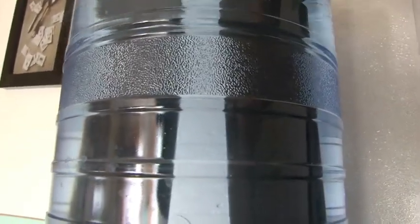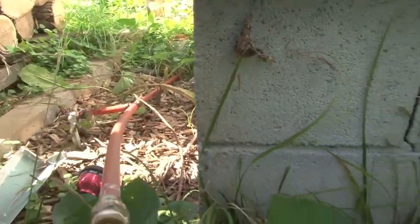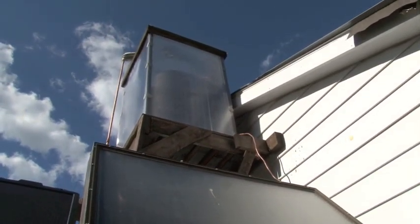I pop the top and the rainwater feeds in, filtering down — that is my drinking water. Now back in the bathroom: there's a T — one branch goes up into the kitchen and the other goes back down into the basement with a valve. It went back outside the house into this copper tube and into this heating panel, because I want to heat up the water — I want to take hot showers with rainwater.